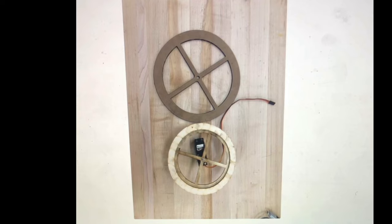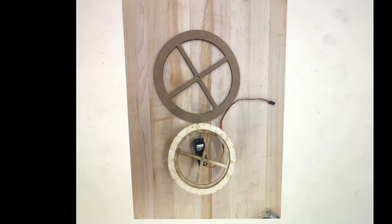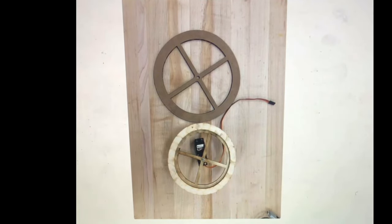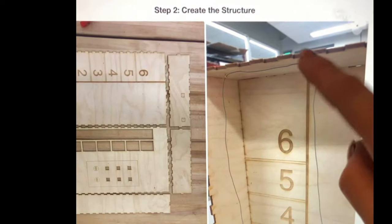The distance the elevator traveled had to equal half the circumference of the wheel. I calculated the distance, and then I calculated the circumference of the wheel. I made the wheel hollow so it wouldn't be too heavy and place too much strain upon the servo. Then I cut two slightly larger circles and sandwiched the wheel between them to act as borders so that the string did not fall out of line. I created a structure by laser cutting a box and engraved a number to denote each floor. I put in two screw eyes at the top to act as the top of the pulley system, and used six individual LEDs placed on the other side of the divider.